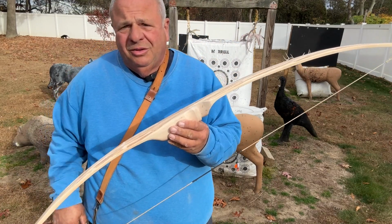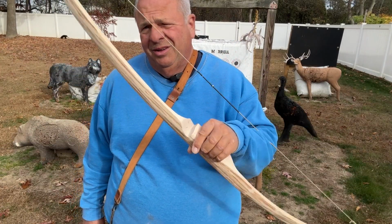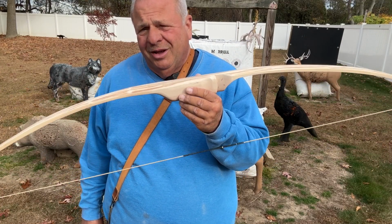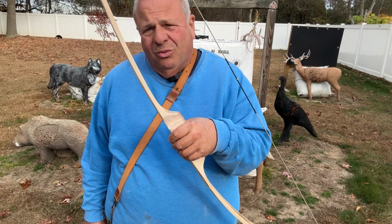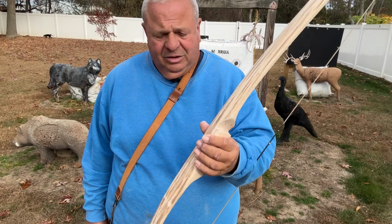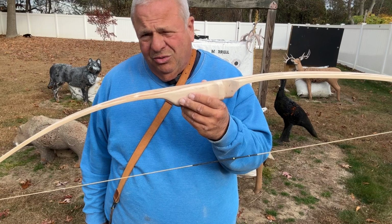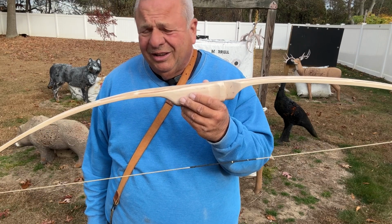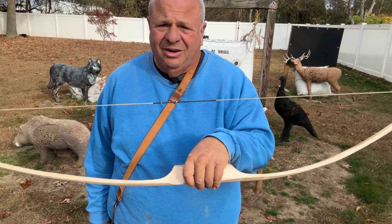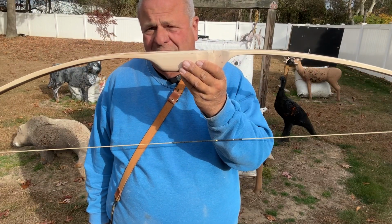So, hop hornbeam. Always make sure there's moisture in it. Don't tiller it if it's got 4%. I don't care. Just don't tiller it if it's got 4%. It's okay to put water on it. Wipe it down, hydrate it, okay, and just take your time and micro tiller it. There's no rush. And when you start not seeing things clearly or you're a little tired, pack up. Start it for the next day. All right, this is a little tougher to work with than hickory. Hickory is an easy wood to work with compared to this.